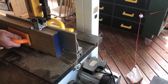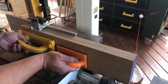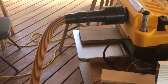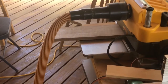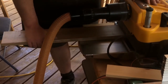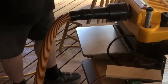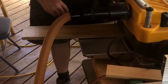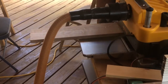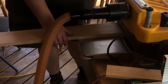It should be known that the trick to getting a good resaw on your bandsaw is, number one, the setup. Make sure you have your blade set up exactly right and it will come out perfect every time. Once I've resawed all the pieces, I'll take them to the jointer and planer. Most of these were already flat so all I had to do was take them to the planer, and this serves two purposes: one, it cleans them up from the resaw and removes bandsaw marks, and two, it gets them to the thickness I want. I'm only doing the jointer and planer as I'm getting ready to use them, because if I do them ahead of time and they sit around for a day or two, that can cause them to warp and bow.